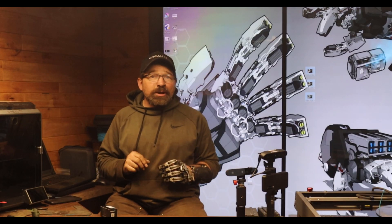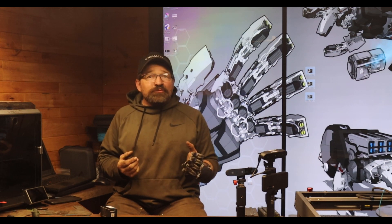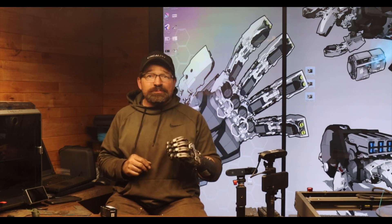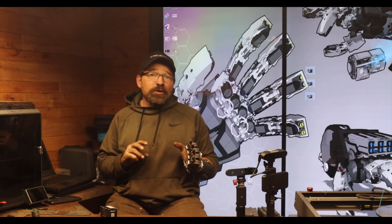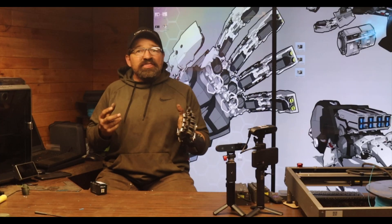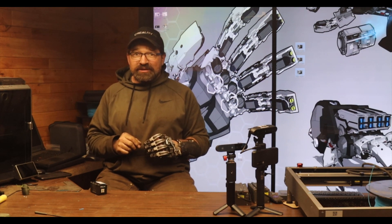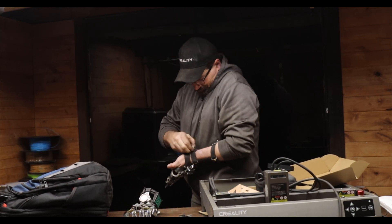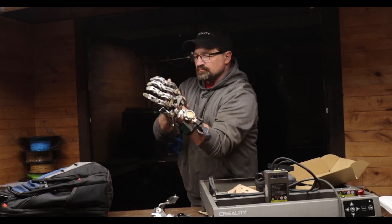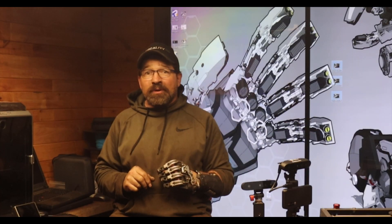You may have noticed I took a couple of weeks off from making videos — it was all starting to feel a little repetitive for my liking. During this time away from YouTube, I've really been putting my prosthetic hand through its paces. Sadly, once again I found that plastic, even engineering-grade PA12 plastic, has proven to be a poor choice as a material for building fingers. This last week I had the P2 of my index finger snap at a most inconvenient time and place. Thankfully I had the previous version of my hand in my backpack and was able to quickly switch back to it for the rest of the day. This has led me to finally pull the trigger and order a full set of finger components in magnesium aluminum from PCBWay. They should arrive in a couple of weeks, and it'll be interesting to see just how hard the SLS material is, being that it isn't a rolled and extruded form of aluminum.